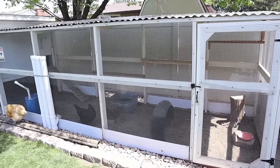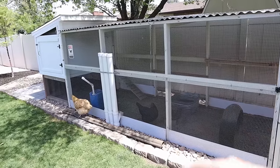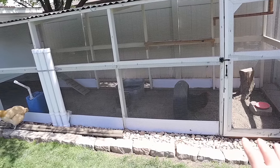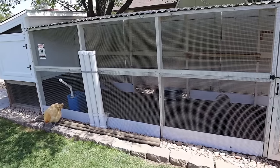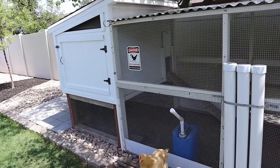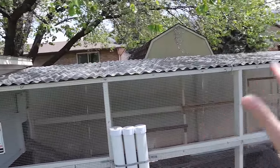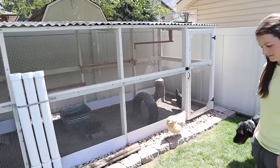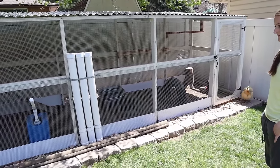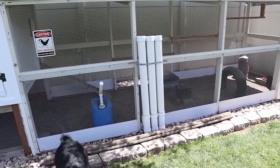The run is about 14 feet long. The back is about five and a half feet tall and the front is five feet tall. I have two 16-foot runners that are two-by-four pressure treated, and then everything else is two-by-fours. It just attaches to the outside of the coop, and we have this polycarbonate roofing that does a good job keeping it dry. The most important thing about a chicken coop and keeping the smell away is keeping it dry — it doesn't stink if it's dry, but if it gets wet in there it gets super stinky, so you've got to keep your coop dry.